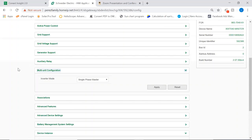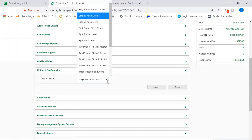This is a multi-unit system, so we have a master and a slave, and this is the section where you select if you're going to have single phase master or single phase slave or any of the variations you can have there. Now, very few countries in the world use split phase. We are not using split phase in South Africa, that's for sure, okay? It is on the South African grid code software version of the inverter, but it should not be selected, the split phase is of no use,